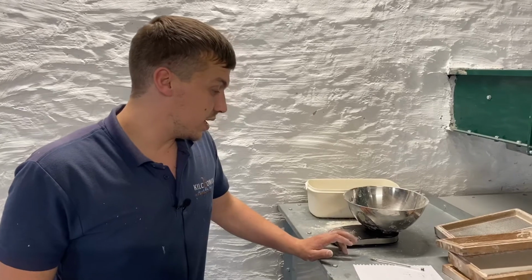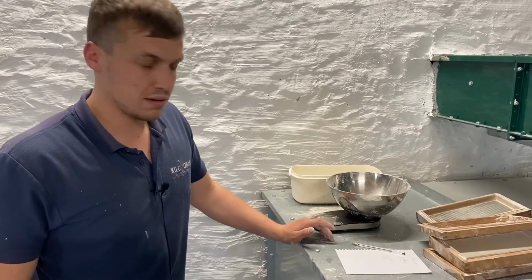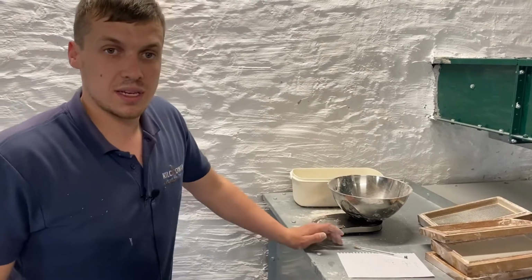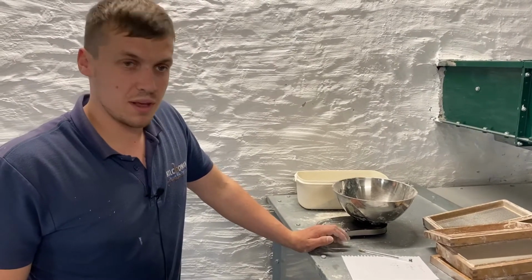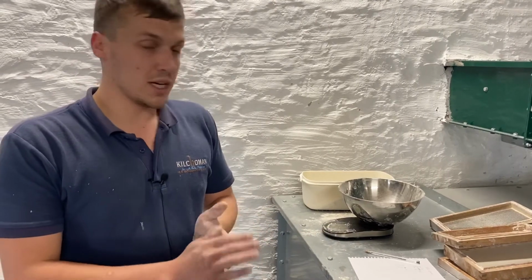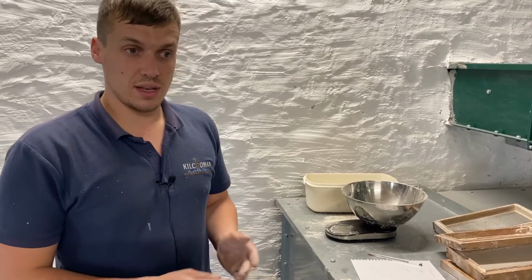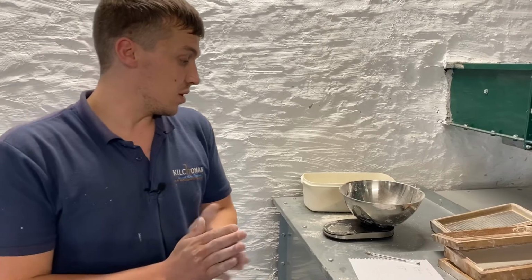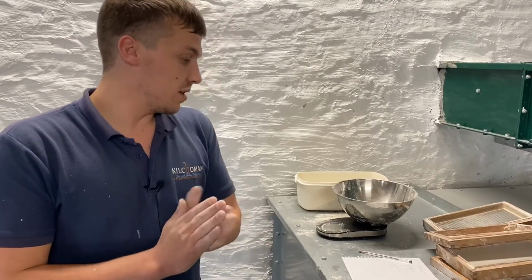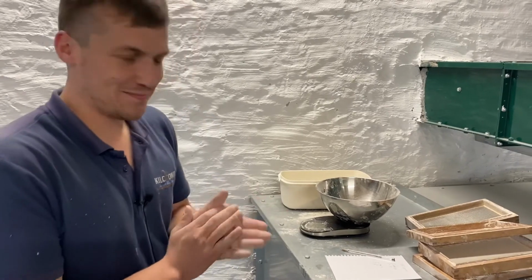The husk's at 18%, the grits is at 73%, and the flour's at 9%. We found that that's kind of percentages we want for each of them. We don't want too much husk in it, or the mash will drain too quick. And if there's too much flour in it, it'll turn into a kind of sticky, like a porridge, and it won't be good. So we've found that these parameters suit us. So it's good for today. We'll mash on.